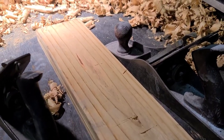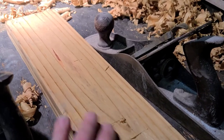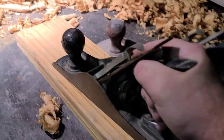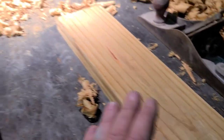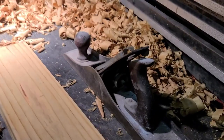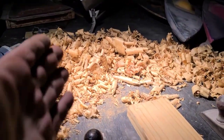Without a setup board I wouldn't know that I cut my notch a little too deep. Here in the shop I wanted to show you guys how I got my board flat. My first board had a little twist on one side I couldn't get out — hence all the shavings — so I started over on a new piece of wood. I used a number five planer and a number six finishing planer. I set my iron really shallow, barely skimming the surface, just to make sure it was flat. I did most of the work with the number five and then took the number six to true it up 100%. With MDF you don't even need a planer — you can't really use one on MDF anyway.